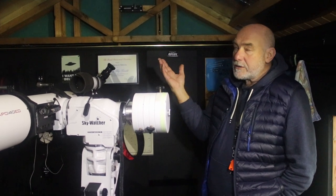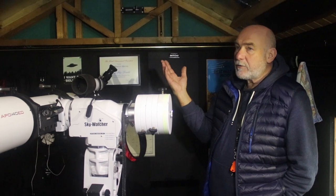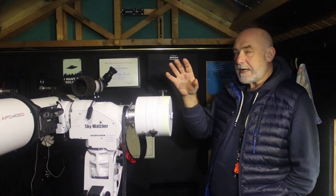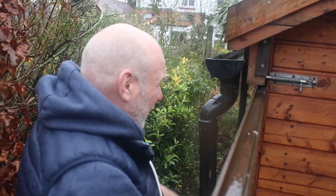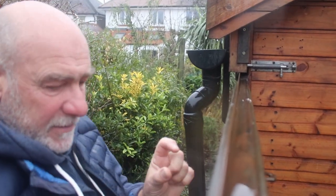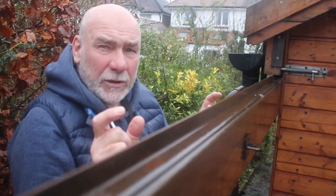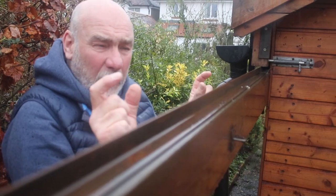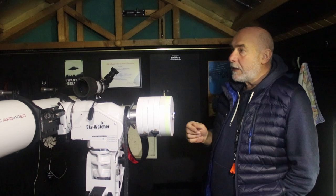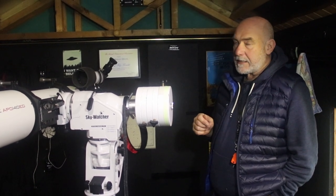It's not rollers or anything else like that. It's little brass wheels from sash cord windows. So the runners on the outside have these wheels embedded in a longitudinal member, and they run on just a bit of angle iron. And by and large, it's usually quite smooth. It's easy to open. It's never seized up.